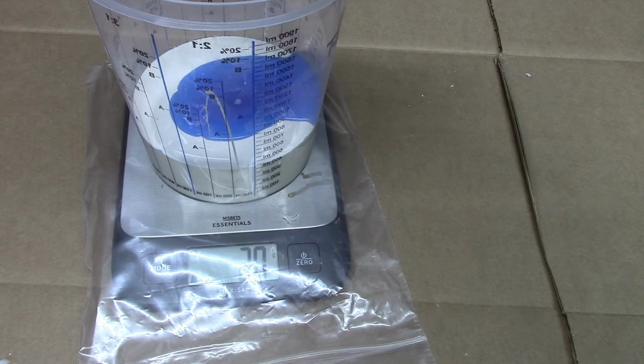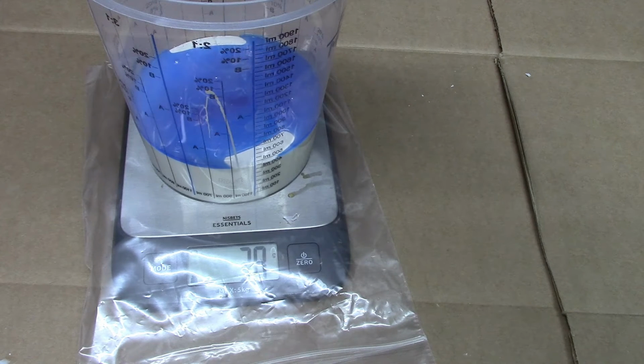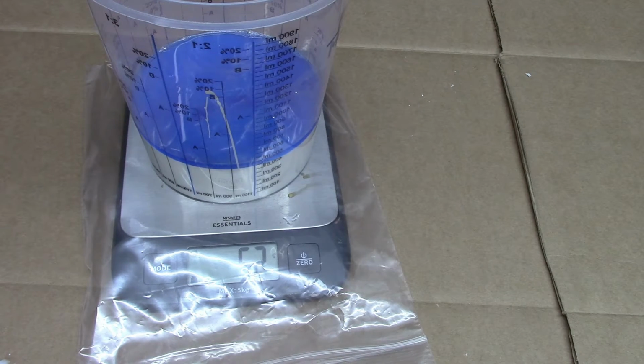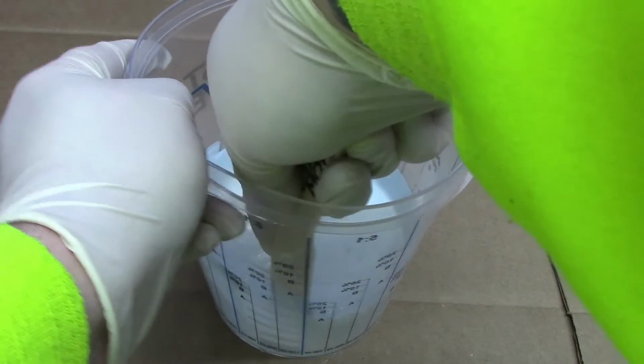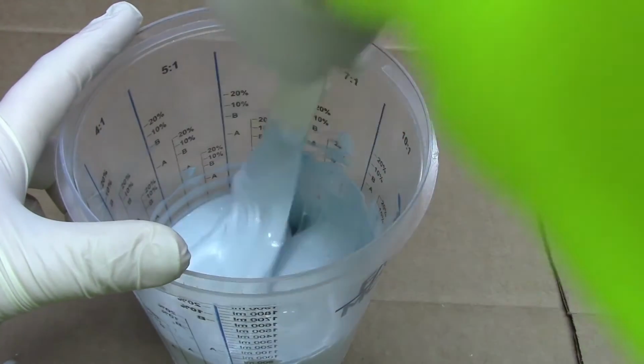We mix our required amount of base silicone with 10% curing agent. Here we're using the fast curing agent, so there's less chance of a reaction with the food product. Some food products can stop the silicone from curing, so always test a sample first. For example, we know foods like onion can have high traces of oils, which can stop the silicone from curing.